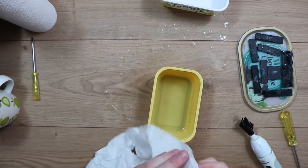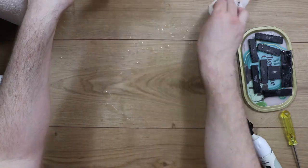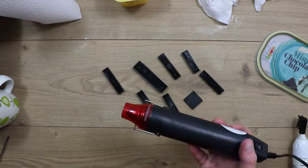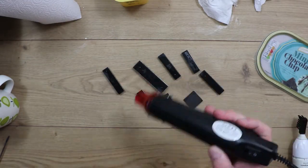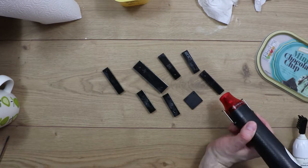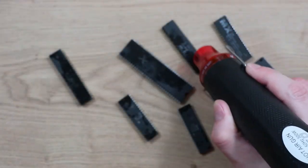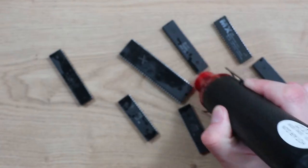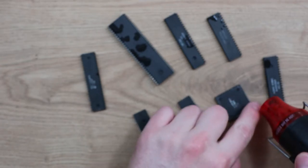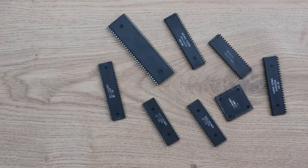That's pretty much that — a nice mess made everywhere, as you can probably see. I'll try to mop some of this up as best I can. What I'm going to do here is use a fairly low power heat gun just to get some heat on here, drive things off a bit, and get rid of the excess vinegar. This will be particularly useful on this chip because of the little holes where the pins sit — the moisture is going to be quite a bit more difficult to get out of there. So that's them at least dry.